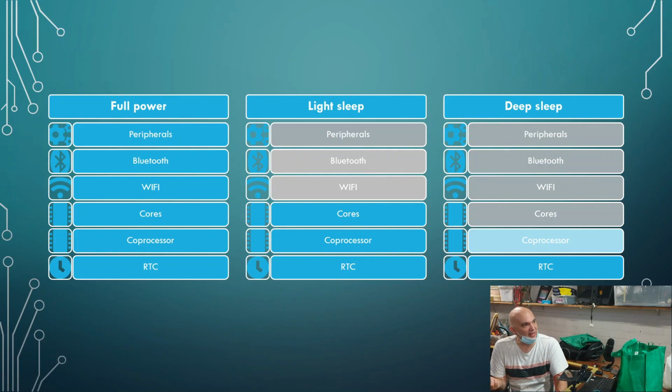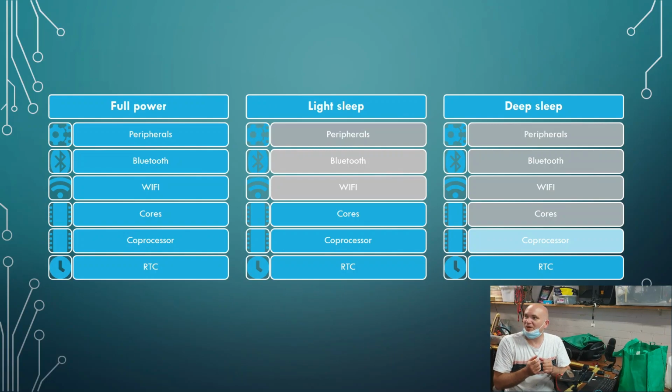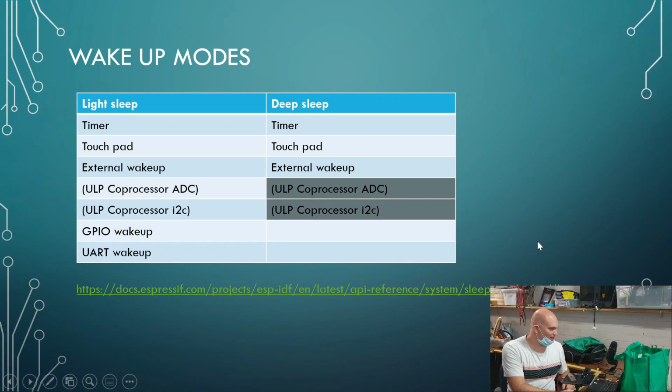It's one of the problems that we have at our work with the Raspberry Pi. The Raspberry Pi doesn't have an RTC. It doesn't have an external battery or whatever. Now, in the ESP32, we have an RTC. It doesn't have an external battery, but it works just the same as an RTC. It keeps its time, it keeps sync, it keeps remembrance of what's going on inside the chip. Okay, and you'll see that actually is an integral part of how things work.